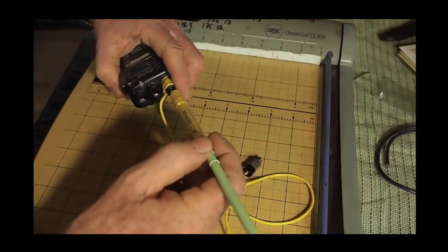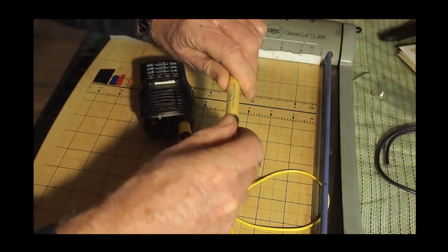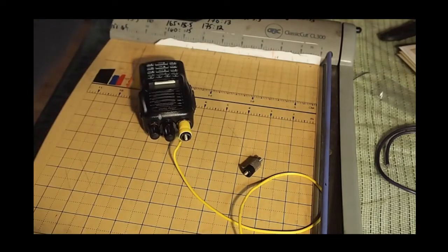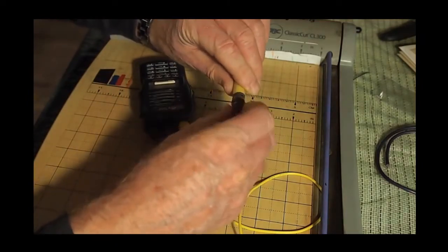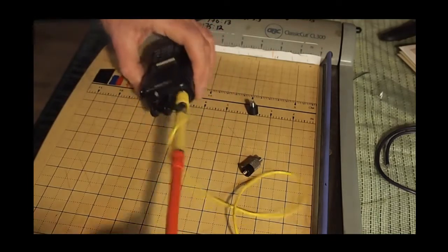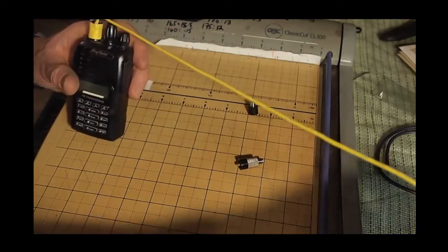You end up with a system like this where we can't use that antenna because it's an IPX7 that has a sealed base. You take your existing base off, and that one's not going to work properly either. With these IPX antennas, we often have the base, and then it goes on. So you're swapping the bases out with the SMA rat tail, for example, like we have. Now you have the counterpoise, which is this, and the tuned element, and you have the dipole.